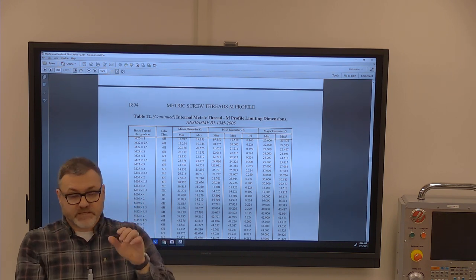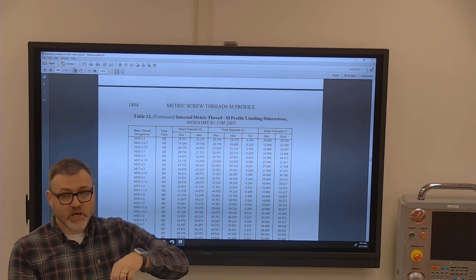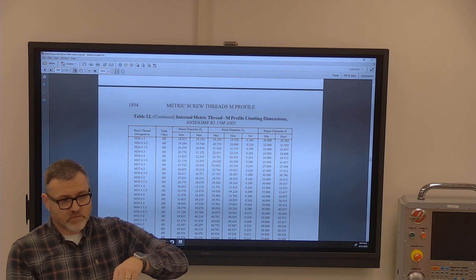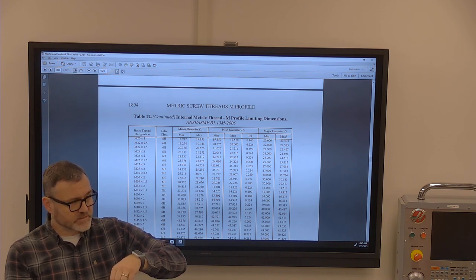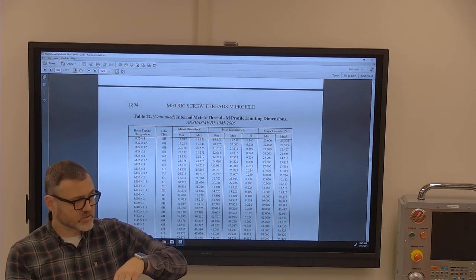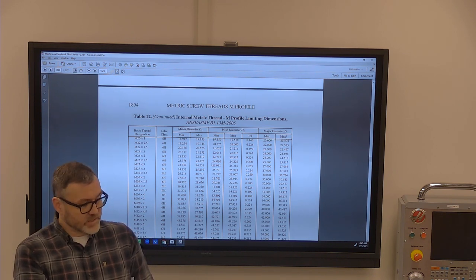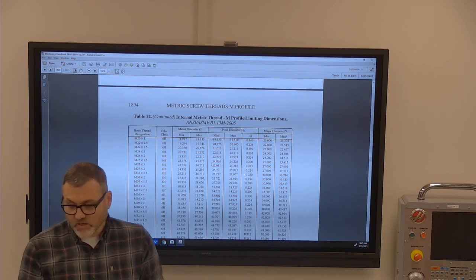And then the danger in the ratchet is that you can start to crank it. So if you go down to the ratchet, hit the ratchet like one or two clicks. Don't, because depending on how much pressure you have, it can start to work like a jack, and it starts to jack the thing up. So now you're going to put it down on there, get it to where you want. You can lock it down if you want to, then take it off.